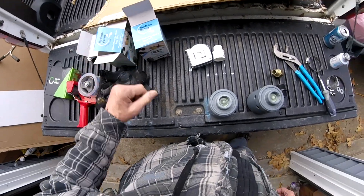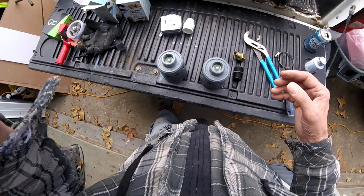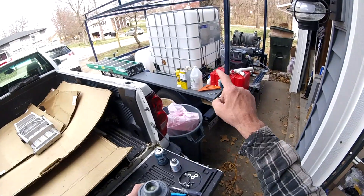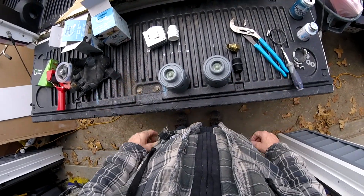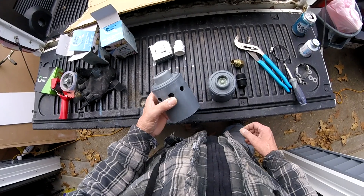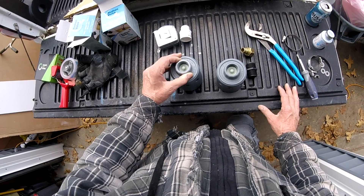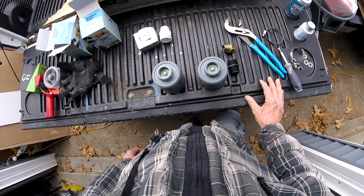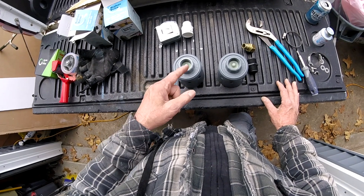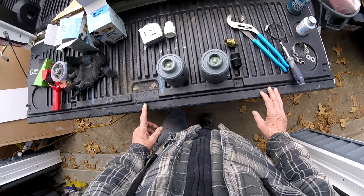We're going to figure out the science of a Hudson valve and why they don't work very well. I didn't know that at the time — I'm building this trailer and I'm going to put two float levels in, one halfway in the tank and one all the way up. So you need two valves. This seems to be the most popular one, so I went ahead and bought two Hudson float valves. These are considered diaphragm valves — complicated science to make them work — and in all these types of valves you cannot ever get a hundred percent flow.